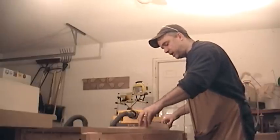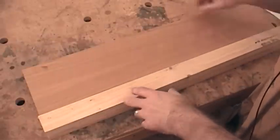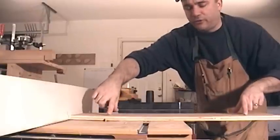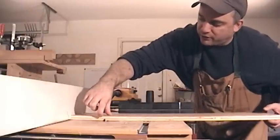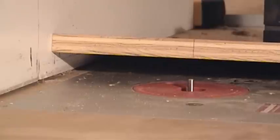I'd like the fence on this jig to be adjustable, so in order to do that I need to create a slot — one on each side of this jig — so it can receive a lag bolt. In order to get the two slots from my fence, I'm going to use my router table and do this in two passes. My first pass I'm going to go halfway through the plywood, and on the second pass we'll punch all the way through.